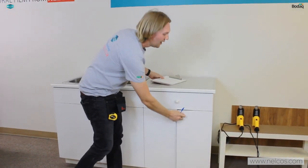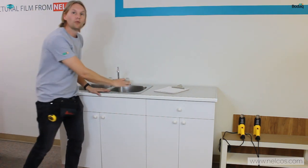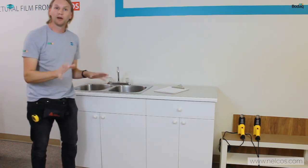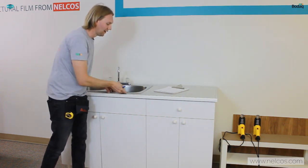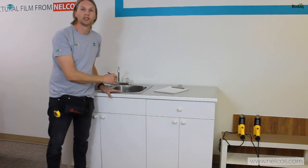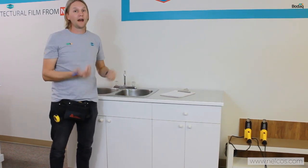One of the other things I want to look at is how easily I can remove the doors. These actually come off just with a click on the back of each one of the hinges, so I can remove and reinstall these doors really quickly without undoing any screws. I also took a look underneath and undid a couple of screws — I did have some plumbing to undo but I was able to easily remove the sink. By being able to remove the sink I'm going to get a really nice clean install because I'll be able to go underneath and put some silicone to really prevent any water seepage. Removing and reinstalling the sink takes about 10-15 minutes each way, so about an extra half hour of work.